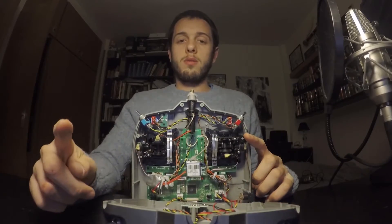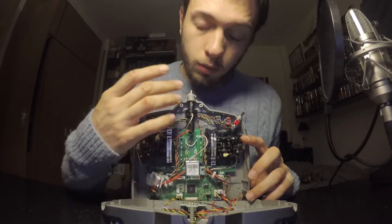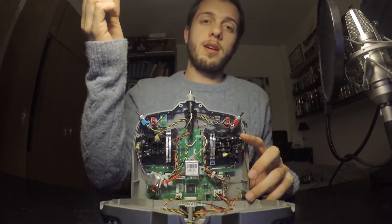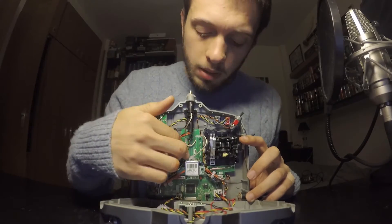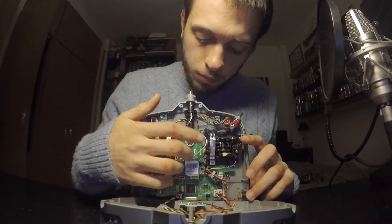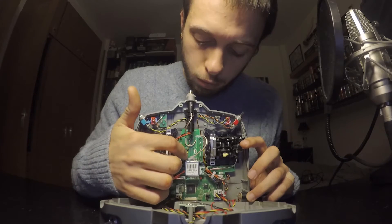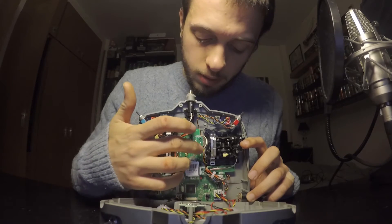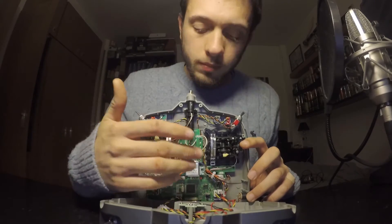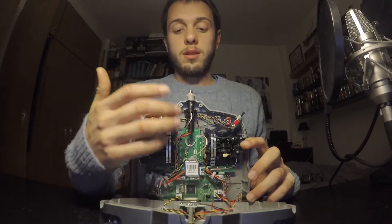So you have your radio open and now you will see what I see. Here is the transmitter that sends all the power to your receiver on the drone. If you haven't done this mod, you'll see that the original cable and original antenna are still here. You want to take that out and unscrew the antenna — pretty easy. Then you want to fit the UFL mini PCI to RPSMA cable through the hole; the RPSMA will fit quite nicely here, and you put the UFL connector on the transmitter. Use epoxy if you can, or like me you can use hot glue to fix the tip on the connector, because the cable is quite stiff and with vibration it can come loose and burn your transmitter if it's powered on without an antenna to dissipate the signal.